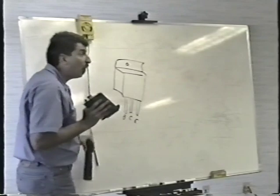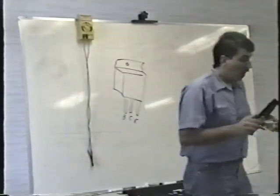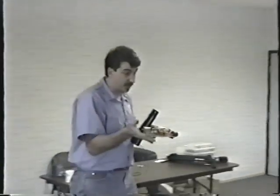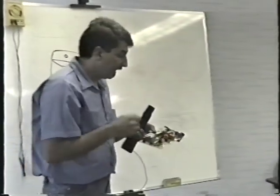The next thing you want to do, first of all, does that make sense? Can you see what I'm talking about? All you have to do is check the transistor from collector to emitter. Do you understand what I'm talking about? The next thing we want to do, are you cool on that, Mark? Cool, all right. The next thing you want to do is check the clamping diodes.